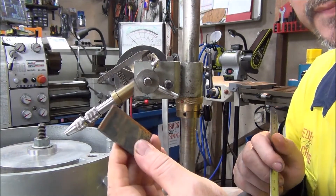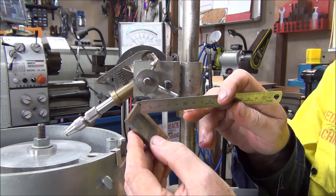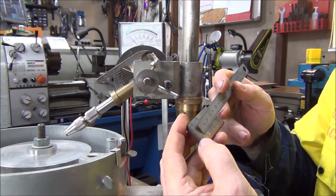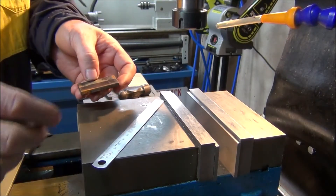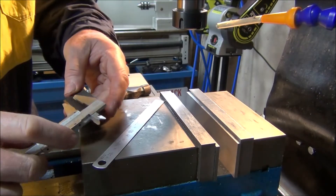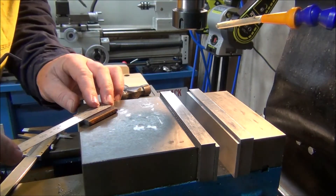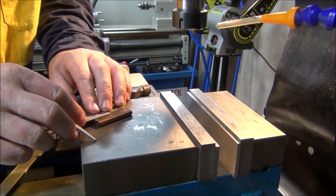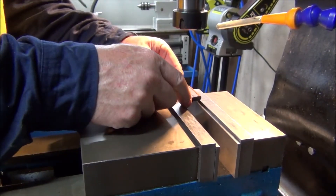I've cut a piece of plate - this is the new bracket. What I need to do now is head over to the mill and cut a slot in there. I think it's a 6mm slot - I'll make it about 30mm long and 6mm wide. I'll head to the mill and cut a slot. We'll just mark it out now so we get the right lengths - 10mm from the side. Okay, it's all marked out, so I'll set it up in the mill.